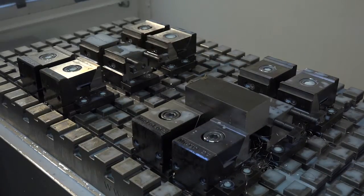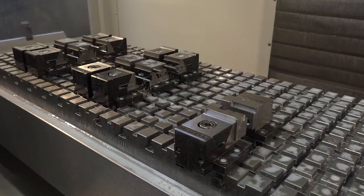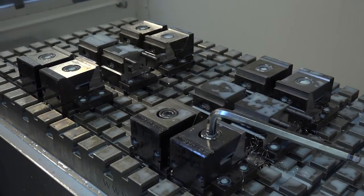It's a grid plate, so tell me a little bit about how it works with the grid plate and positioning. The grid plates are in increments of 150mm, so you can put multiple vises on there and know your increments of 150, so you can work-shift them to suit. When it comes to programming, you know the position of the clamp — it's either 150 or 75 — so the positions are known values and you can do your work shift.